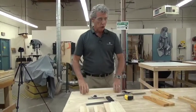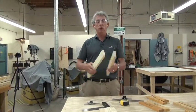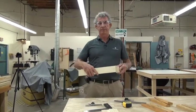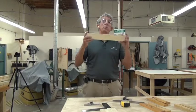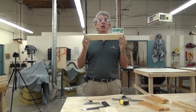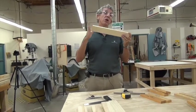We'll start off with a really simple joint. You don't have to do the butt joints — they stink. What I've already done for you is this board's ripped to width, squared one end, cut the length, so now I'm ready to go. If you don't trust me with that wood, cut off the end and you'll know you're square.